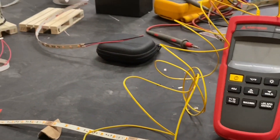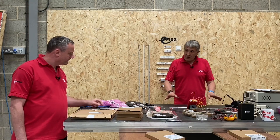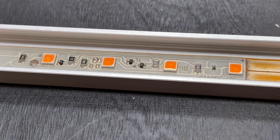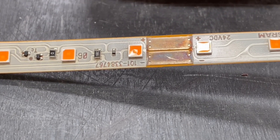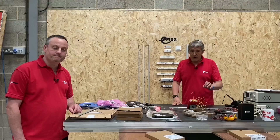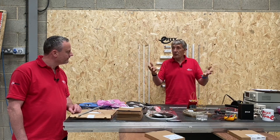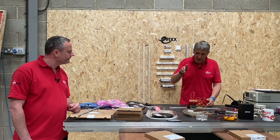What I've set up here is a length of Osram Linear Light Power Flex LED tape that takes about 18 watts per meter. I've cut half a meter into two lengths — one installed in a piece of aluminium profile and the other in free air. I've attached a thermocouple to the TC point, which Osram uniquely provides on their LED tape — a dedicated reference point on the PCB to measure temperature. A lot of manufacturers just quote an ambient temperature, but ambient where? In the room? Up in the ceiling? The TC point gives you a precise, consistent measurement location.